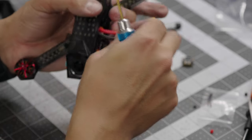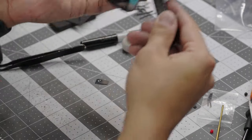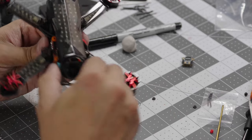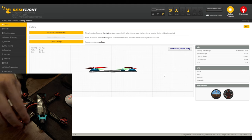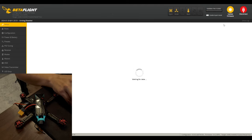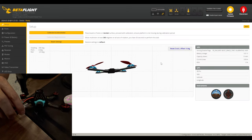The rear antenna — we do have a mount on Printables that I'm going to print later. There it is — you have a finished Tiny Trainer HD and it's ready to be programmed in Betaflight. Let's jump over to the computer. We're going to plug in our drone and get going on setting up Betaflight. The first thing we're going to do is rotate our AIO because whenever I put my nose down that front arm is going down — you actually have to rotate it 45 degrees. We do that by going to Configuration, Yaw, set it to 45, save and reboot. Then double check it by moving the nose of your quad: nose down, sideways goes sideways, back goes back — now we know the board orientation is correct.